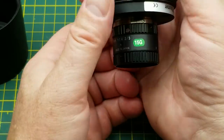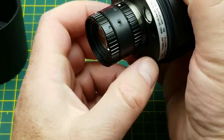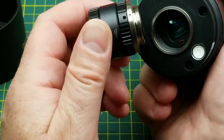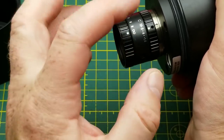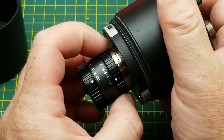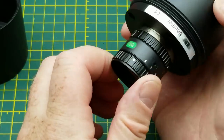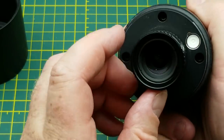It's got a little made-in-Japan lens here. I don't see a manufacturer name on that lens though. It is a C-mount — just a small screw-on mount, which is quite common in industrial cameras and security cameras. I think one of the new Raspberry Pi cameras can also take a C-mount lens, which may prove to be interesting. The aperture goes between 1.4 and 16, or C which I guess is wide open, and focus from close to infinite.